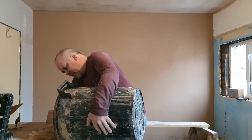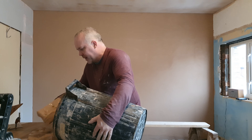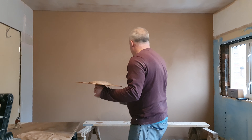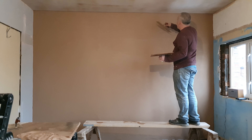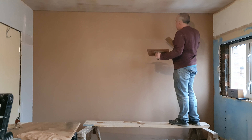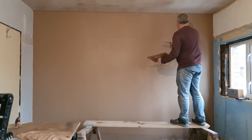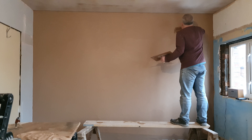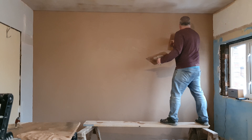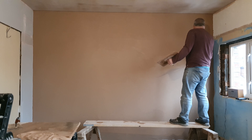About half an hour later: you can see the first coat is still rough — it's not meant to be neat, just getting that first coat on and letting it shrink into the nooks and crannies and the joins in the plasterboard. Touch it now and it's not sticking to my finger, so it's good for the second coat. Once I set up and knock up some more plaster outside, this will be ready to go. Second coat is about to go on — knocked up some plaster, much better mix this time.